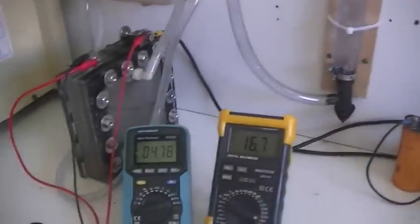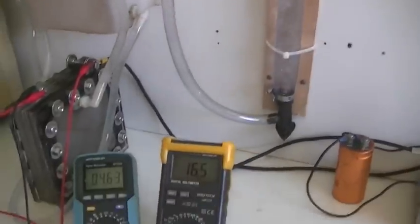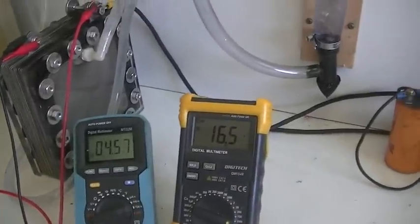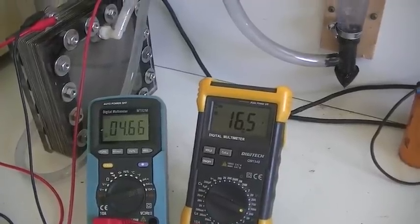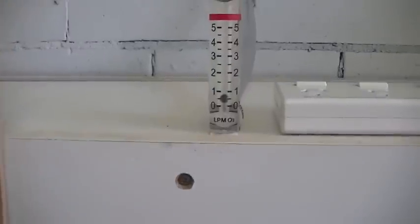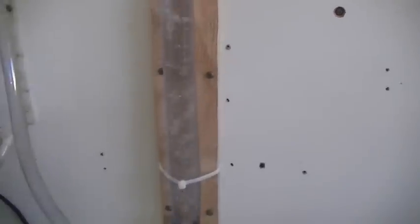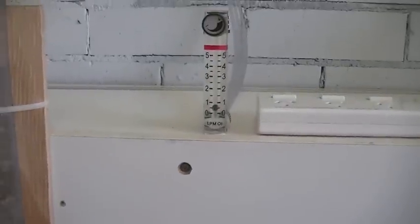Thanks for watching. So we've just done a quick calculation and I'll add this on to the end of the video. The MMW for half a litre a minute — that's actually dropped a little bit now — but from the calculations and the numbers in the video just a while ago, we have an MMW of about 6.3. Going on the half-litre-a-minute side we're slightly higher than that, so we're very close to the 6.5 we would expect from this cell. That's also a good indication that the flow meter is fairly accurate.